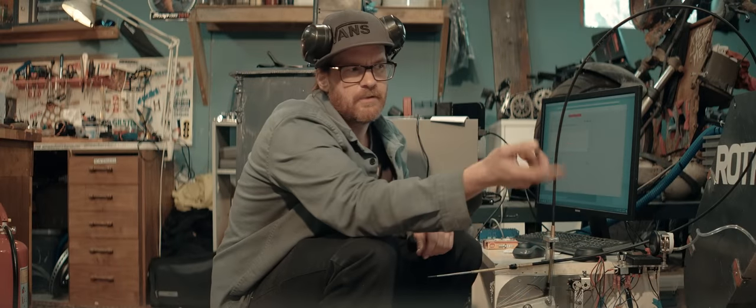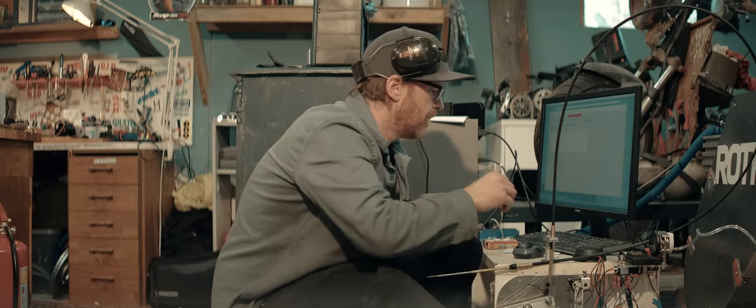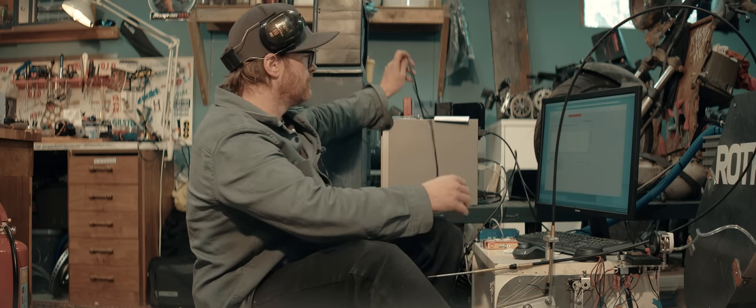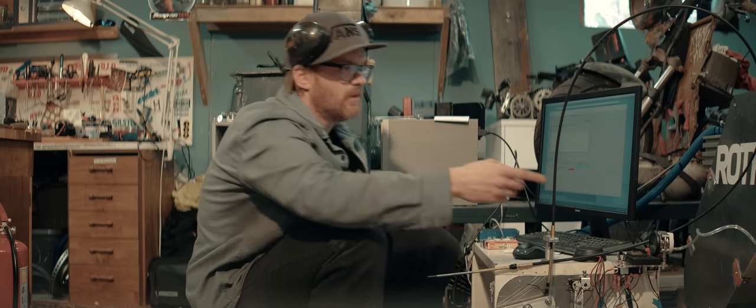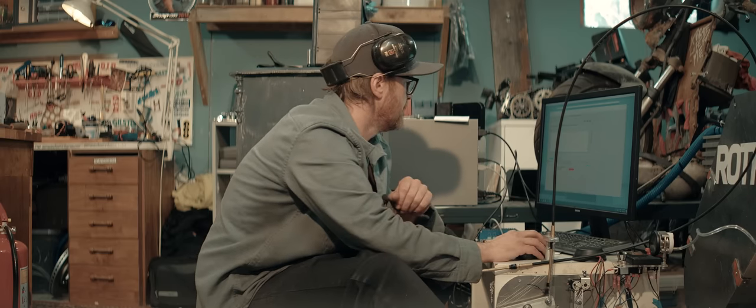On second thought, it could be the large crankcase volume making it act like it's rich under the power band. I'll move the point of 30 degrees of ignition advance to 10,000, then ramping down to 14 where it's at 15,000, and then we'll downjet if it doesn't help. When I'm saying not under load, it is pulling the whole assembly. There's just no power connected to the retarder.